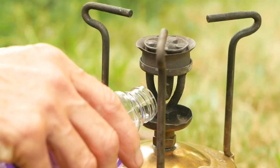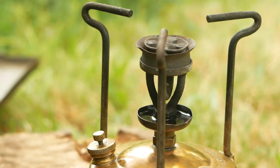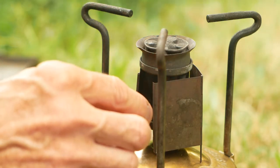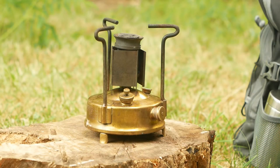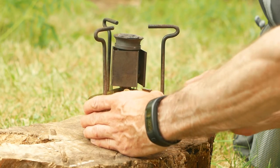We're all set ready for preheating the burner now. Pour some methylated spirits into the meths cup and place the folding metal windshield round the burner. Grab your box of matches and light the meths. It takes about a couple of minutes to heat the burner — keep an eye on the meths. When it's nearly all burnt, close the vent screw and give it a few pumps, and with a bit of luck the burner should roar into life.